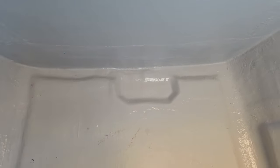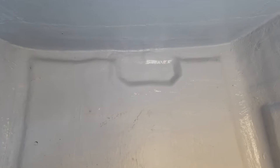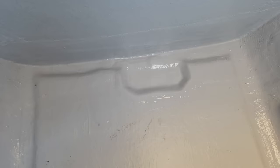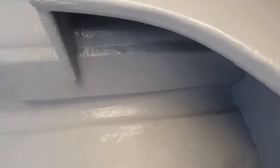That's pretty good - as good as it needs to be. I'm going to have to make a base for the float switch to sit on because I do not want to screw through that solid glass hull. I've also finished the rudder shelf and the reinforcements - that's all now flow coated and it looks beautiful. Once I'm finished fitting everything in, I'll re-flow coat this floor here to make it nice and clean for when we're barefoot and travelling.